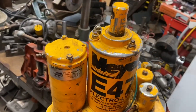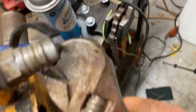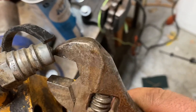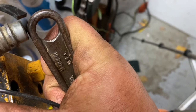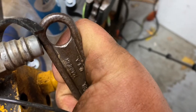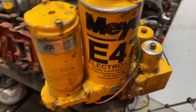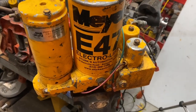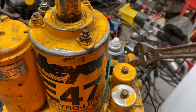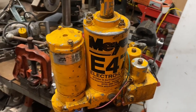Now of course this is a hydraulic unit. Hydraulics are dangerous. So before we take this out and spin it out, before we do anything, a little focus. Push the ball in there. Don't use your finger. There's no pressure there. Then when we take this off, we'll take it off slowly. Just be careful with hydraulics, even small compact units like this. If you're not sure, take a fitting off slowly, far away, and it'll start leaking if there's pressure in there. If it starts leaking, then stop and readdress the situation.